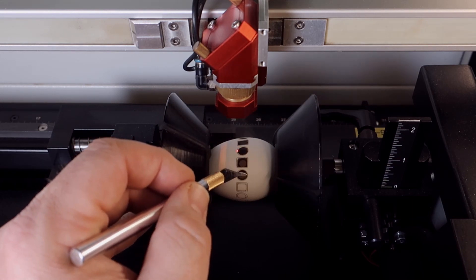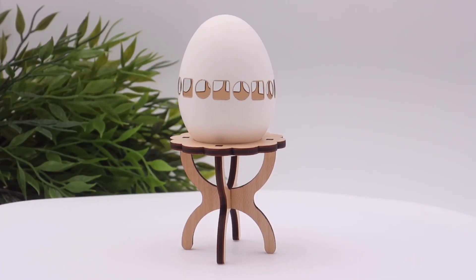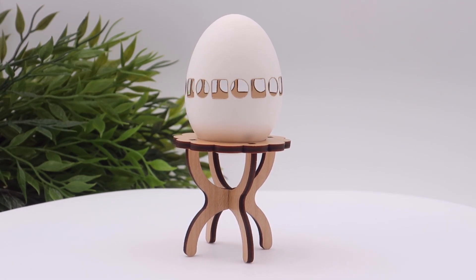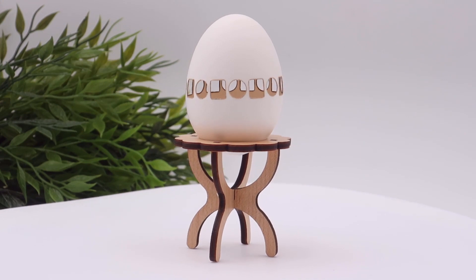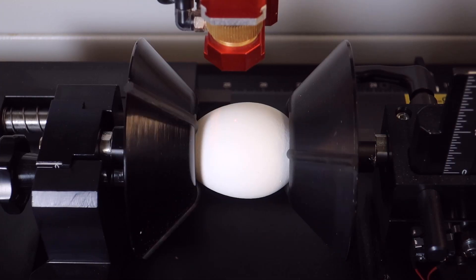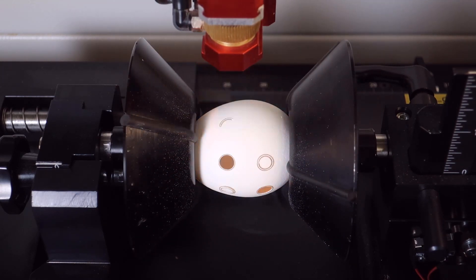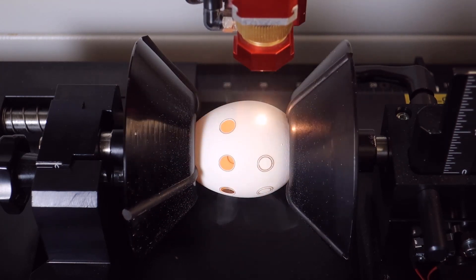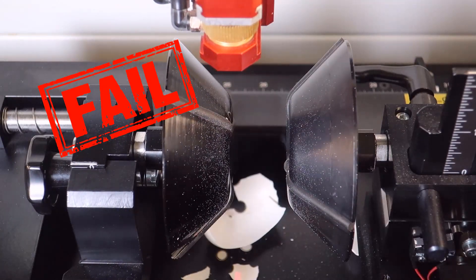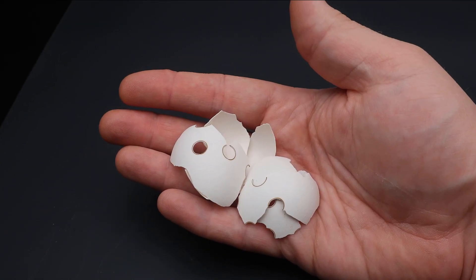Initial results look encouraging. The parts had to be popped out, but around the equator I got a decent looking cut — a little bit of charring on the edge, but the stability was good. I did not use the wax-filled eggs for this due to the fact that I didn't want excess heat to melt the wax. I tried cutting three different rows all the way through with the same graphic, but my concern proved valid — without the wax inside, the pressure of the rotary caused the egg to actually collapse.